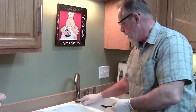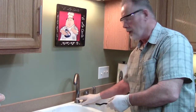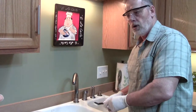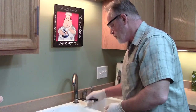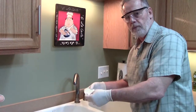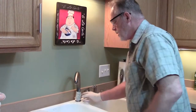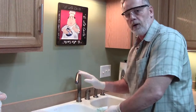If you have to — let's say you've got a really heavy deposit like the photo that the member had shown — you might have to apply a couple of applications. In that case, because it was so heavy, I would agitate it first with a nylon brush so we're not going to scratch the finish. Then go ahead and apply the paper towel with vinegar on it, let it sit, give it plenty of dwell time, come back, take the wrap off, agitate it again, and then clean it like you normally would.